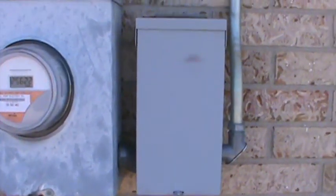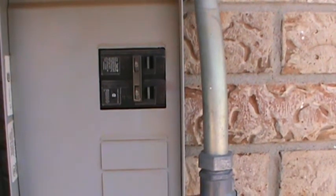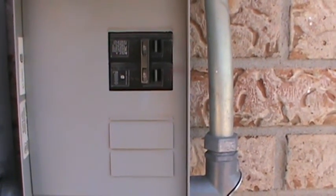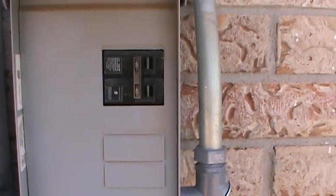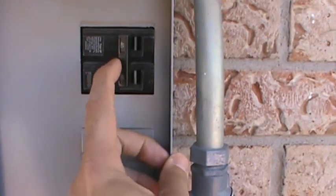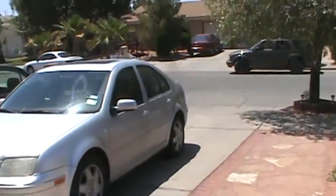This box right here is the circuit breaker for the AC. When I flip on the switch, you're going to hear arcing inside the circuit breaker, which indicates either the circuit breaker is bad, or there's a problem over where the compressor is — something connecting together that shouldn't. So we have a short somewhere. Stay quiet and you'll hear the arcing inside this circuit breaker.